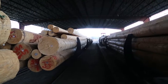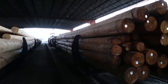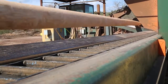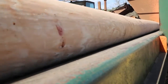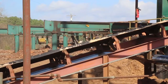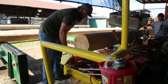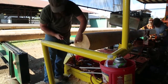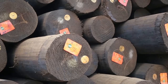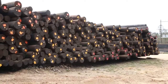Next, poles are dried and sterilized to kill any decay spores that may be present in the wood, a process that normally takes 1 to 3 days. After the poles are dried, they are spread out on skids for framing and inspection. Framing consists of cleaning any bark left over on the poles from peeling, putting required gains on the poles, boring all necessary holes, and applying burn brands or inset metal tags to the face of the pole. The tags identify the producer, date of treatment, preservative, required preservative retention, length, and class of the pole.